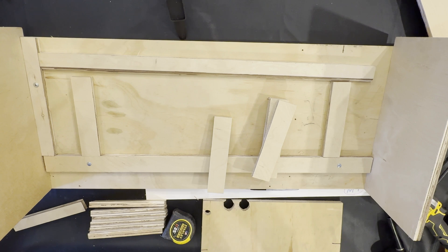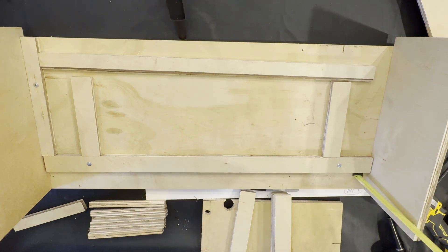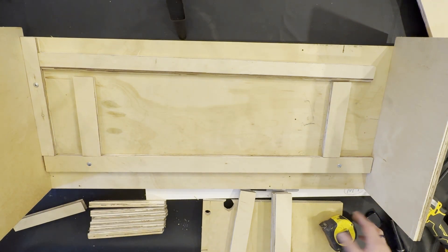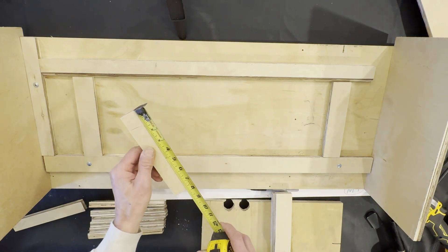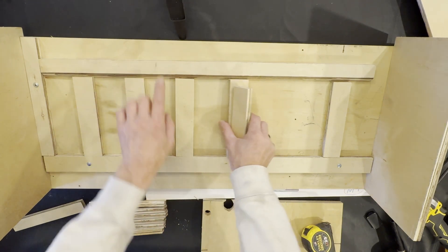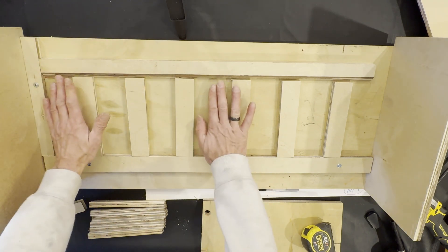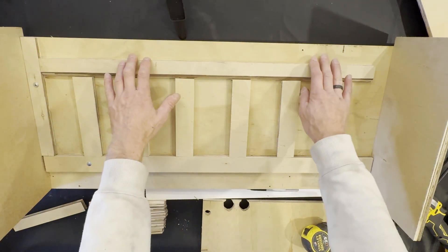You can see I have this box slightly rebuilt. It's eight and one-eighth inches tall because our KS-0 Pros are seven and seven-eighths, so we'll have a quarter inch of space just in case. I have several pieces cut at seven and three-quarter inch to separate each of my seven miners and screw them in with spacers so they don't shake around. I cut them at 45 degrees so the airflow goes out pretty easily. That's pretty much it, so let's get it built.